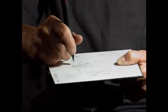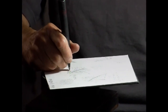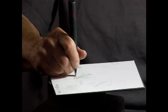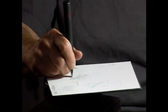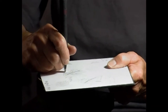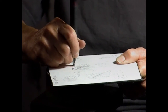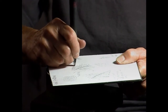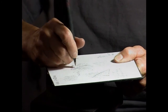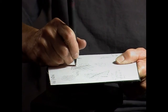If I want to make a curve, I'll do what I told you not to do, and I'll kind of tilt my tool a little bit so just the edge of it is touching. When you do that, don't hit real hard because your tool will kick out and leave the area. And all of this, you can raise this metal and you're not going to lose your detail.